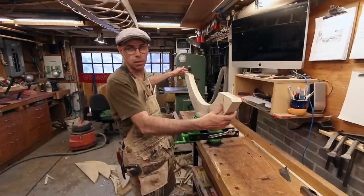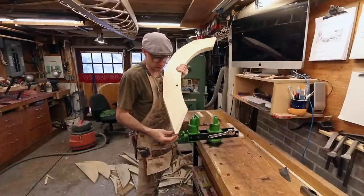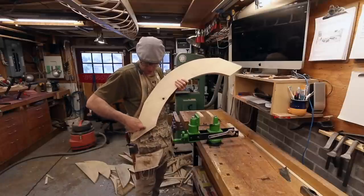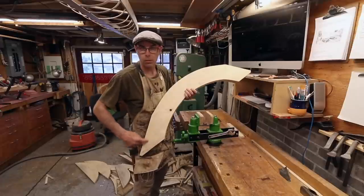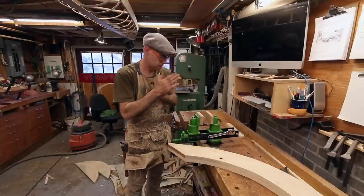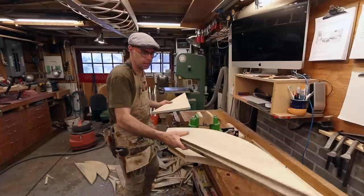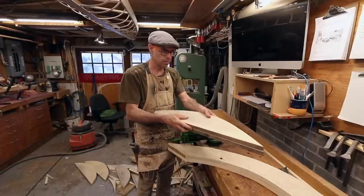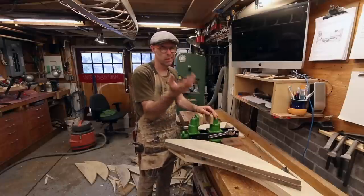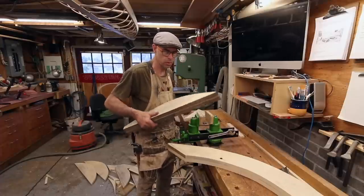The transom had the shear line and then the next plank down takes a hard turn, and then the next ones take a different turn, so in order to design the boat I had to really factor those in. The last thing I'm adding in here is that arbitrary reference line — the just-in-case line. On the bandsaw I really cut right to the line. I skimmed them on the belt sander, barely taking off anything, mostly focusing on flattening out the surface the bottom is going to rest on, and making sure the center line is flattened out a little bit. I can take all my little off-cuts and rip those down to make blocking, so I'll reduce the waste down to a bare minimum.